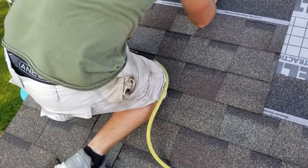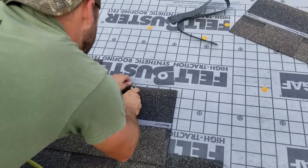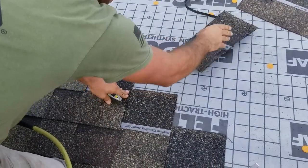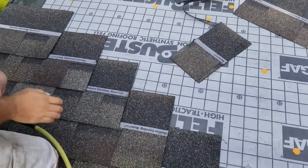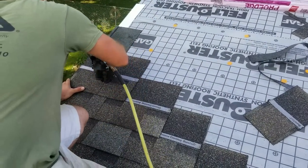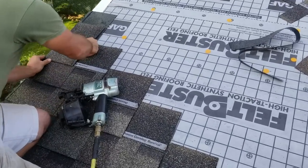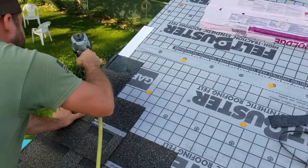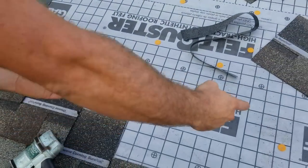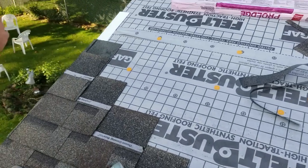Take your knife out for two quick cuts, make it nice and straight. Don't nick that bottom — you never want to touch anything in here. That one's a little bit big for my taste, that's okay — big stair steps. So when you get to the valley it's nice and quick — you're not going to be stuck in the valley for too long, just two or three shingles and boom, you're out of it and back to your run. Always finish your stair step before you drop back down.